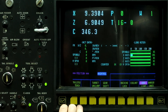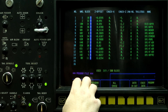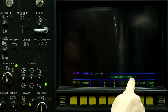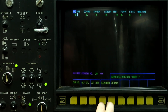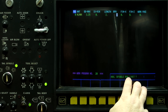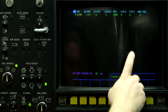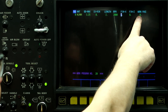First thing we're going to do is push the left button, go to program, program file, and select a work number that's not listed. I'm going to select work number 20. Go back to program, push work number 20 input, and if it's a new program, push the program button. Mazatrol. Work piece material is aluminum. Outer diameter is 3.25. Inside is zero. It's two inches long. Max spindle RPM limit — this is the lathe spindle limit, not the milling spindle — so you can type in 2000 like we normally do. Finish allowance on X and Z is not going to be used in this program, so I'm going to leave all these blank.